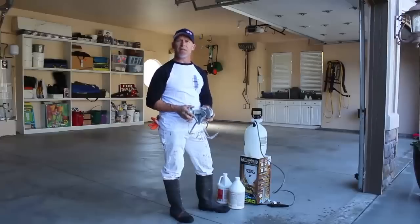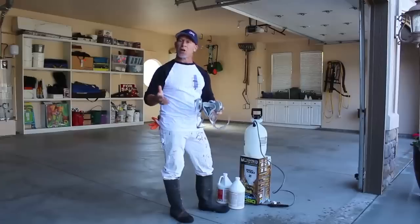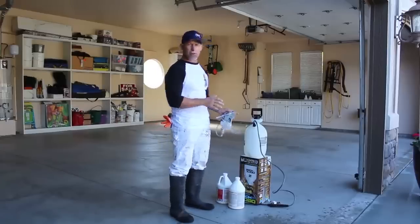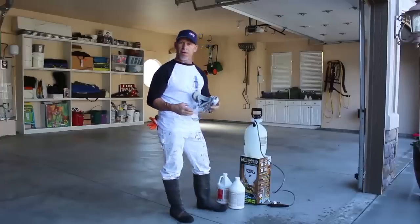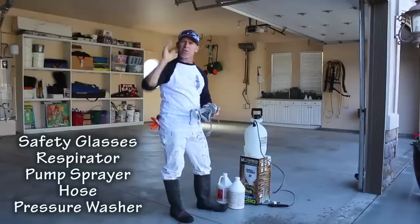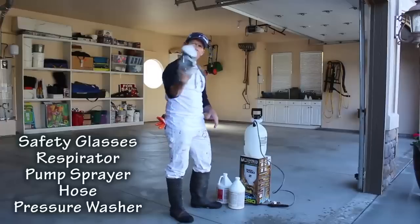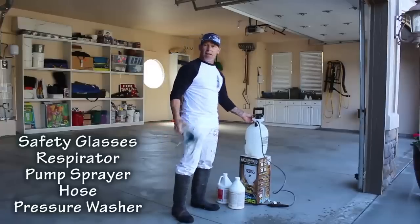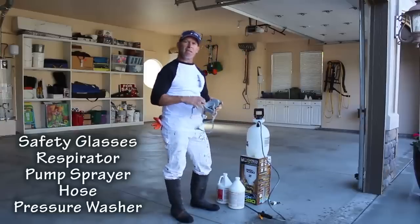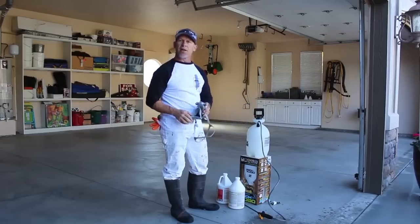I've been doing it for about 15 years, and I've never had a callback on one of my floors peeling or pulling up, so the process works for me, and I'm going to show you this process right now. There's a few tools that you're going to need, and some of the most important things are safety equipment. I use a pair of clear goggles so I don't get any muriatic acid in my eyes. I use a safety mask, which has a chemical filter on it. I got a 2-gallon pump sprayer, and then I got my muriatic acid, and then I got my hose set up out here with my power washer outside the garage, ready to go.